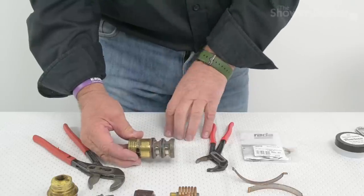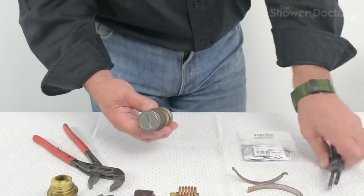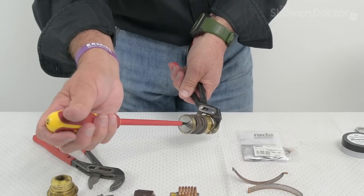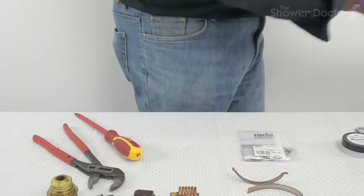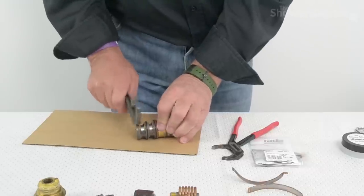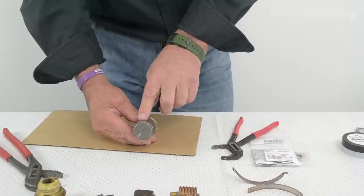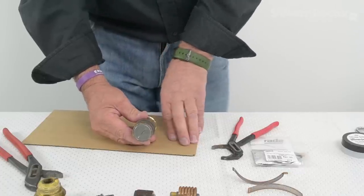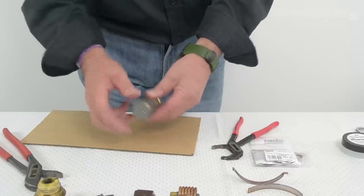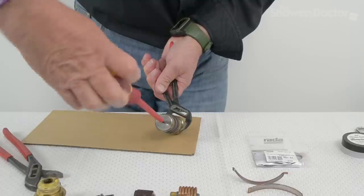This is the one inside here that often causes a problem — this can be difficult to remove. In the first instance, if there's a screw thread in here, you need to hold this and unscrew this. Now that doesn't always come apart very easily — it's brass and stainless steel. So what you sometimes need to do is go around this and give it a sharp tap, not too serious, just a good sharp tap, and that will sometimes release the stiction. If for any reason that doesn't come away easily, the next thing to do is get a kettle of boiling water and trickle some boiling water over it, and that will expand the brass just enough that it should release it. In this case it should come out fairly easily because this one was done earlier. So it's pretty straightforward — this just unscrews, hopefully. That was easier than I expected, and it comes out like that.